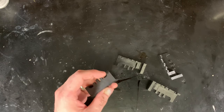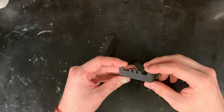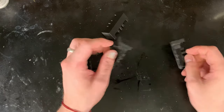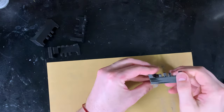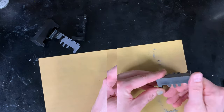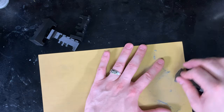And that brings us to our 3D printed parts. 3D printed parts are great but if you put some work into them they get a lot better. There are some 3D printing lines visible on these — they're actually pretty well done — but I'm going to sand them completely flat and then put a filler primer on them so you won't be able to tell they're 3D printed at all. I'll start with 320 grit and I suggest you go a little slower than it looks, because you will melt the filament and then you have even more work for yourself. For the tricky corners I'm using an emery board — I get these at the beauty supply store and I love them for little sanding projects.